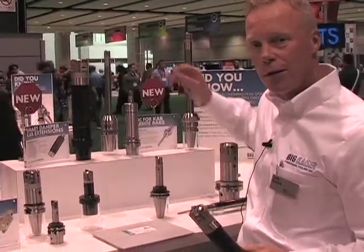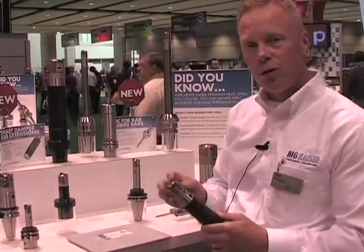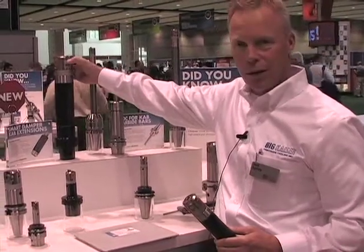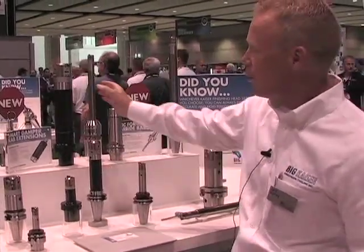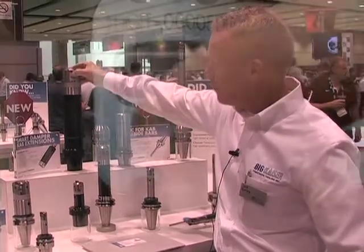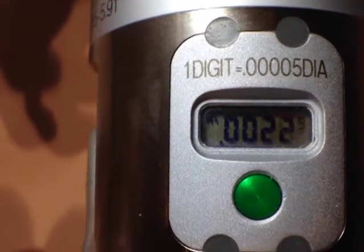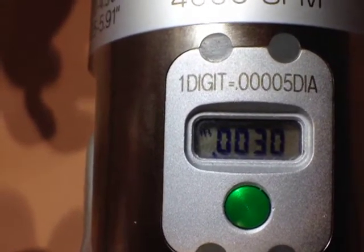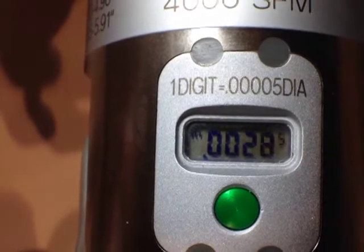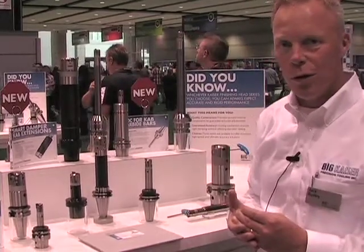All the tools we have described here are for finish boring. All of our standard finish boring units will fit onto it, so this can be our standard tools or even our new proprietary digital heads. This unique new system allows customers to adjust their tools using digital readouts. Here you can see a digital display being turned on — it shows the diameter that it's currently set to. They can zero out the diameter, make their adjustment, and all the adjustment is strictly on the tool. It's reading the actual movements of the tool carrier inside the tool, so no operator has any false readings about what the tool is actually measured to when he uses it.